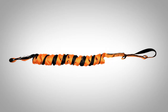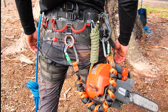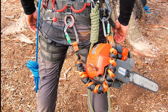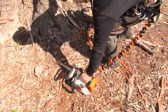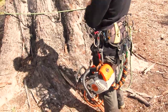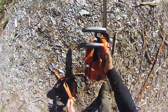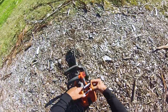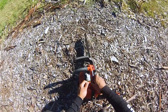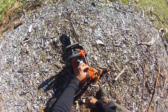For the handle connection method, use the second carabiner loop to hang your saw. It repositions the way your saw sits on the back of your harness, keeping the bar and chain away from the back of your leg and your saw sitting higher on your harness. It also allows you to hang your saw on and off of your tool hook with one hand. To connect the Full Reach to your saw handle, first locate the second carabiner loop. Pass the large eye from left to right under the handle and perform a girth hitch, choking the lanyard down securely at the back of the handle. Ensure the second carabiner loop is located within the girth hitch and attach your hand carabiner.